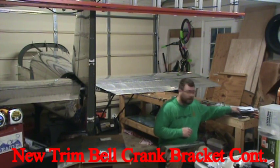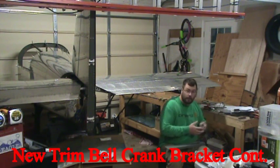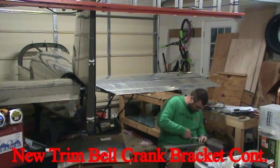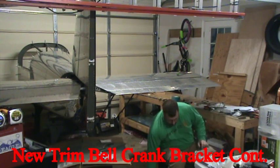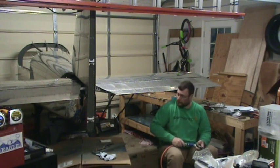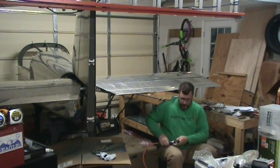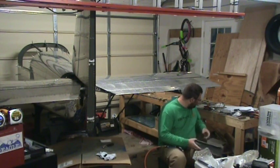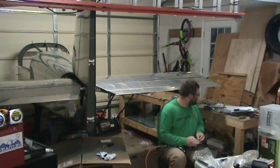So we're just going back to repairing this piece, and then I'll go back and pick up step two. This time around, I want to make sure to install the right rivets the first time and to have the manufacturer head and the shop head on the correct side, as indicated in the drawing.